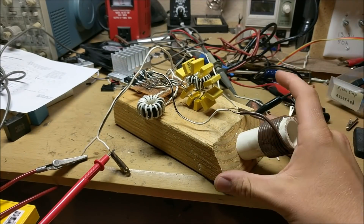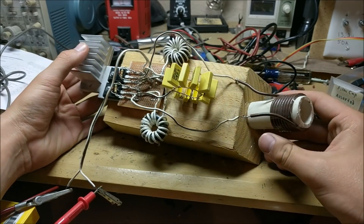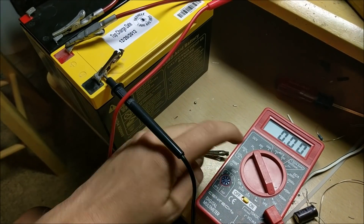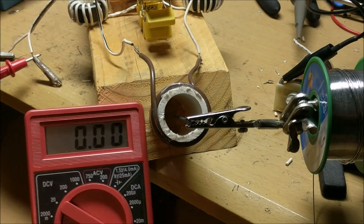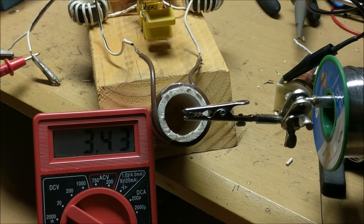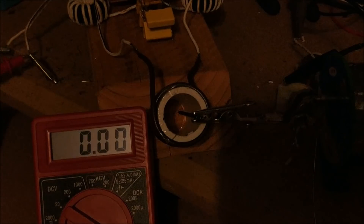Finally, after maybe a week and a half of building and experimenting, I finally got my induction heater to work. So this is the final project — it's mounted on a piece of wood and this is the coil in front, that is the work coil. This is being powered by two sealed lead acid batteries, and I've got a multimeter right here that reads out the current draw, because the current draw actually changes as it starts heating up something. Let's turn this on and see what it can do. With no further ado, I'll set this multimeter right here and we'll see that nail heat up. You should see that nail heating up really quick. As you can see, the current draw goes up. The nail is glowing red hot. Let's watch that again in somewhat dark — that thing just glows red hot. If I take it out, you can see that it's still glowing red but it cools off and the current draw drops a lot.